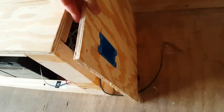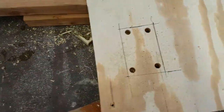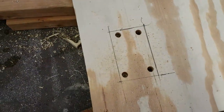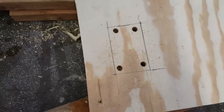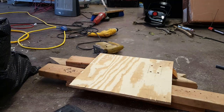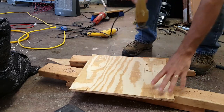I cut out this box for this panel over here — it's going to fit right there like that. I'll show you how I did it on the next one. I marked my box and took a 3/8" wood drill bit and drilled four holes in the corners so you can see where my box is going to be. Now I'm going to take my saber saw to cut the hole square out for the box.